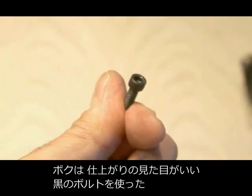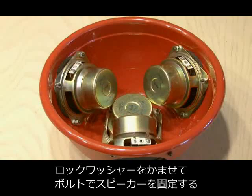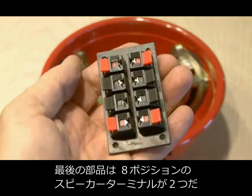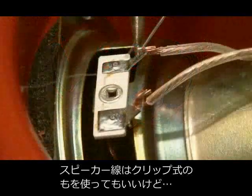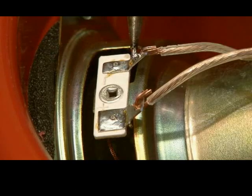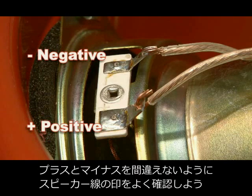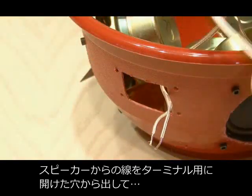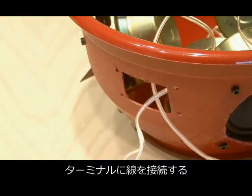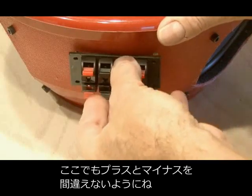I chose some black bolts because I thought they would have a better looking finish for the end result. Then using some lock washers and nuts, I attached my speakers. The last part you'll need is two eight-position speaker terminals, and we'll use these to attach our speakers to our music source. While you could get away with using crimp-on speaker connectors, I wanted a more permanent installation, so I soldered my speaker wire to my speakers. Now remember, there's a positive and negative for each speaker, so be sure to check the markings on your speaker wire, or else you're going to have phasing problems when you're done. Then run the speaker wires through the hole that you cut out for your eight-position terminal, and complete your connections on the terminal. Be sure to remember which is positive and negative, and make that match for every connection.